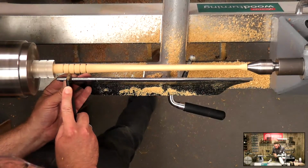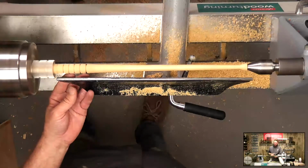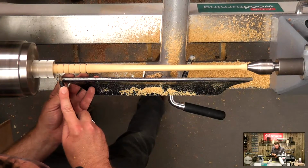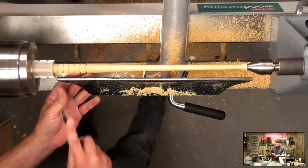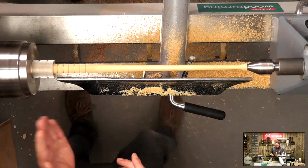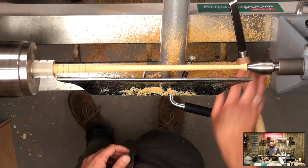And put a little bit more of that one, and we've got room for one more here. And being extra careful now, I'm really close to the chuck, so being really careful with these cuts. And I'm not going to come in that way. I feel that that's a little bit too close for comfort. I'm just going to gently tip over the skew and just tidy up that face on that side. But I've not come in at such a hard angle on that one. Good.